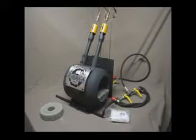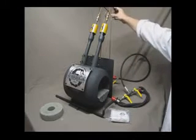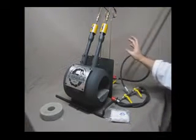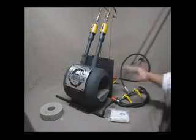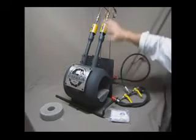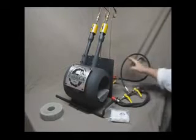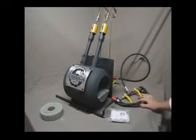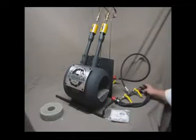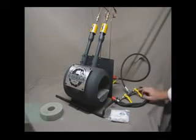Then what we have is the plumbing at the back. Many people ask me why this is, and we'll get to that at a later point in this video. You have got the plumbing, which features the gauges, the regulator, the two main cock open valves, primary for the primary burner, secondary at the back, as well as the needle valve. Then coming over to the hosing, these two bull noses will obviously fit onto your LP cylinders. As indicated on the actual regulators, an open and shut position.